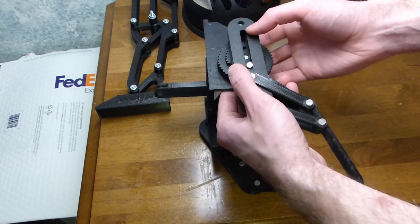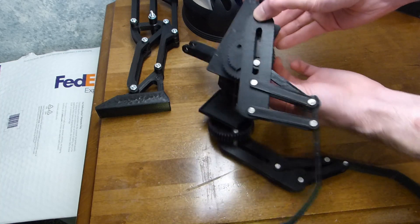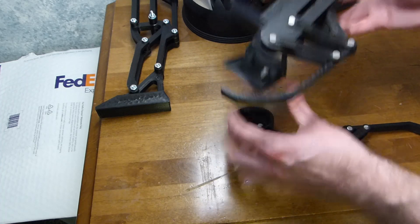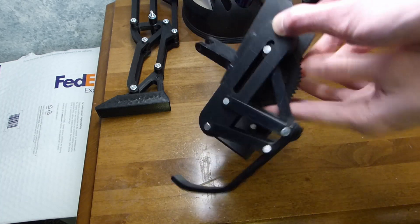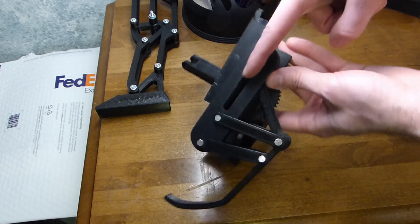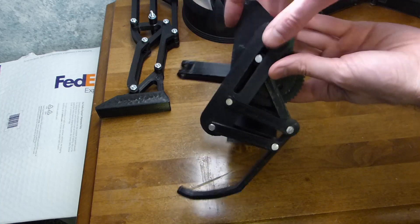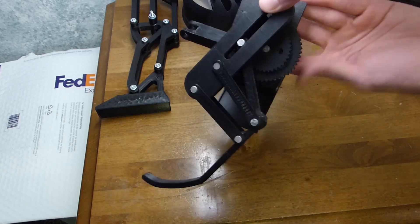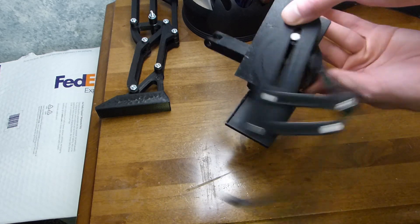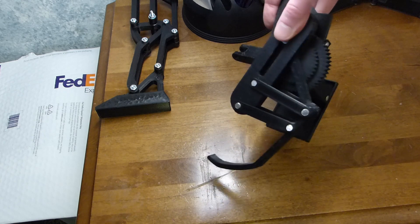I still like this older project. This one was mainly shown in Part 2 of the Four Leg Walking Robot Development videos. I was thinking that instead of using this wheel, I could just have two linear actuators — one to slide this control up and down to extend or retract the leg, and another one just to bring the thigh forward and backward. I still like this mechanism, it's still in the running. Some people had asked for the models for this. I don't have models for this right now, but I might make new models for a leg based on this sort of linkage.